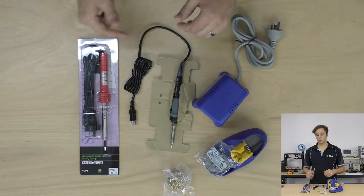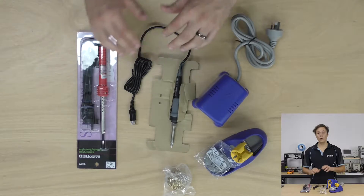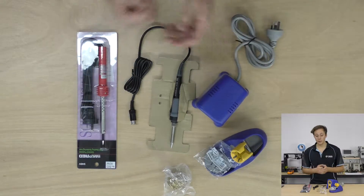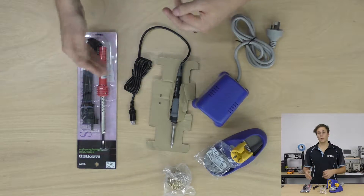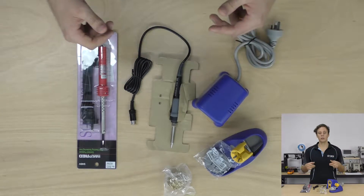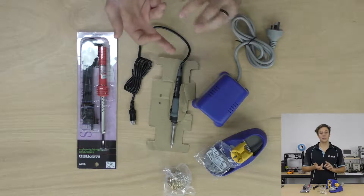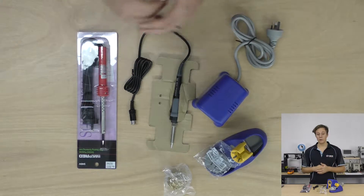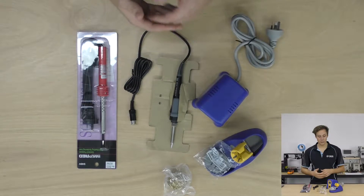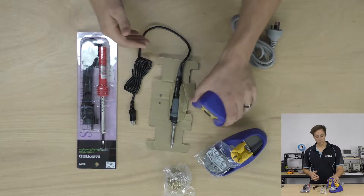This is awesome to keep in the toolbox. If you get yourself a good quality one, it's only going to cost you no more than 20 or 30 bucks, which is great. It's super portable. But if you're working on a benchtop and you're working with different types of components and different solder profiles — lead free versus leaded solder have slightly different melting temperatures and ideal soldering temperatures — you want something that has a really good stand. You're going to want a soldering station.